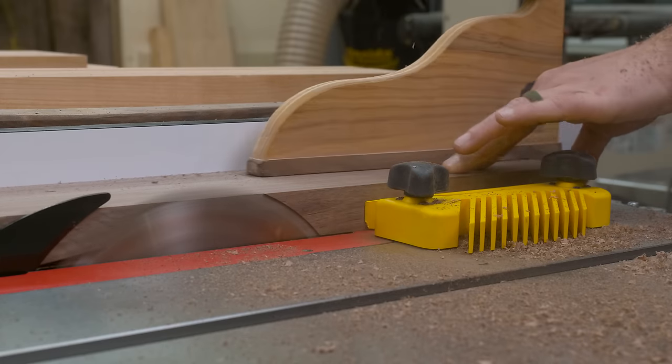Finally the base was ready for assembly. I'm going to use glue and pins — just a thin layer spread over the joint. If you wanted to be able to disassemble the bench, you wouldn't want to use glue; you could always go back and drill out the draw bore pins. But this is the more permanent solution, and it's the way I wanted to go. One great thing about draw bore pins is the lack of need for clamps — since the pins essentially are the clamps, I can just move from one joint to the next and put everything together. Assembly went pretty smoothly.